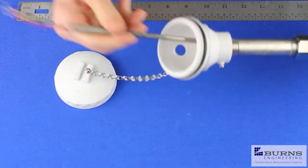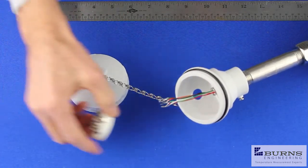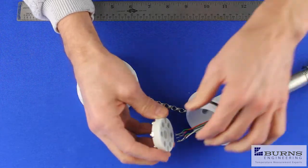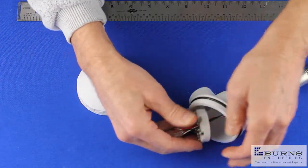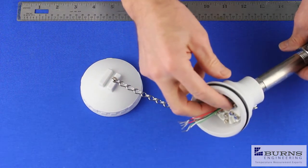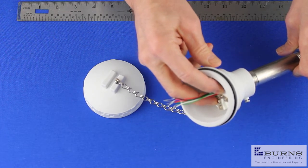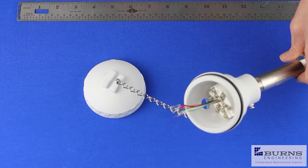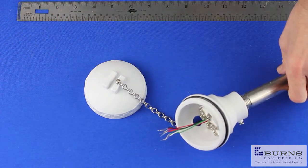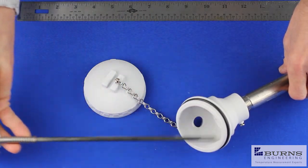When we screw this all together, the threads engage about a half inch, so the pipe nipple overall is four inches. But after it's installed, it's just three inches between the thermal well and the connection head, giving us that same nine inch total bore depth. The probe slides right inside the connection head, and the terminal block has a little hole in the middle — just thread the lead wires through that. The terminal block hits the spring, pushes it down, and holds the probe firmly in the thermal well. Two screws hold the terminal block in place. To pull the probe out for recalibration, simply undo those two screws and pull it out as an assembly.